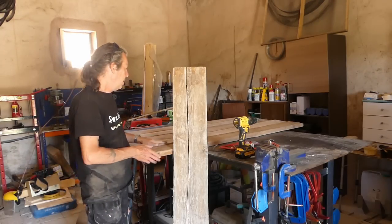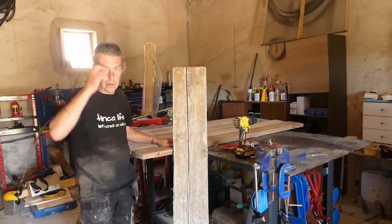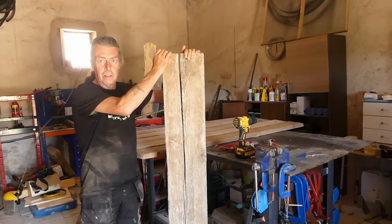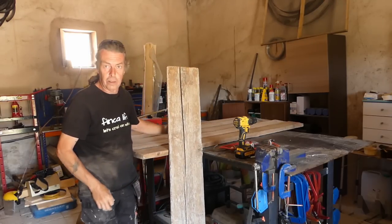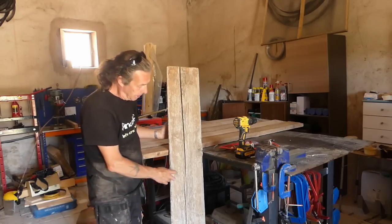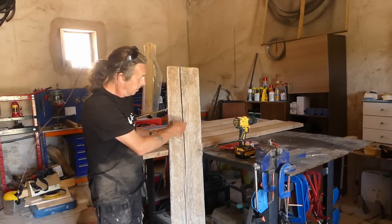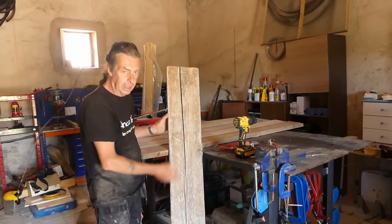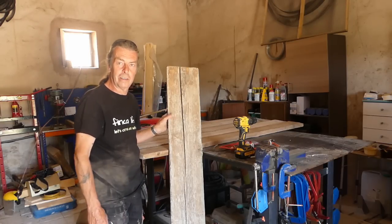I've got all my boards cut - they're 880mm in total and I want a total of 1050mm. I've got this last piece which has a big massive split down it, so I need basically 170mm. I'm going to take 85mm off each side, which I've got enough for, and that will just leave me a bit of split firewood. I need to get out the table saw, get that set up and get this one ripped down, then we're ready to start putting it together.